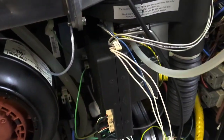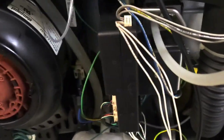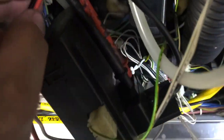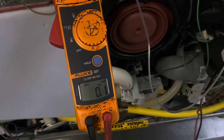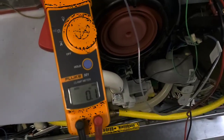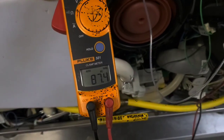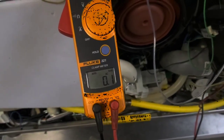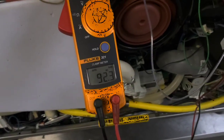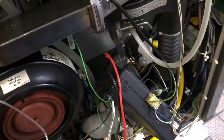I'm suspect now because I get nothing out of this brand new gas valve. I can't test it in circuit, so I'm testing it out of circuit. I got my test leads jammed in there — this is the meter. Shut this door. That's voltage to the gas valve. I guess it's supposed to be 120 volts? I'm pretty used to it being 24 volts. Anyway, it's unstable — 120 volts and it drops off and does funny stuff. The only load on it is the multimeter. I guess that's why the brand new gas valve doesn't help.